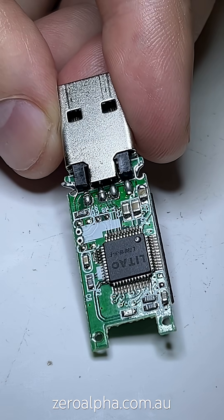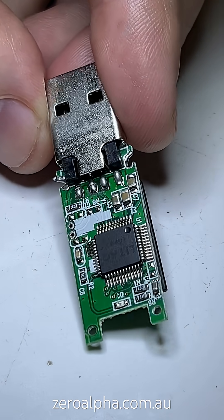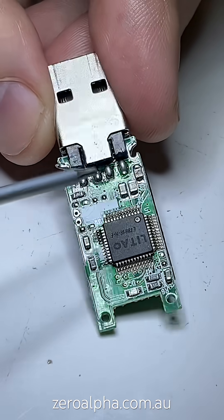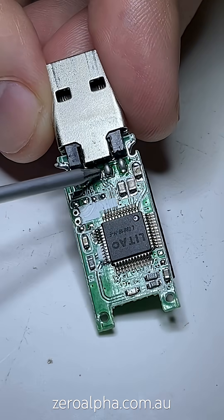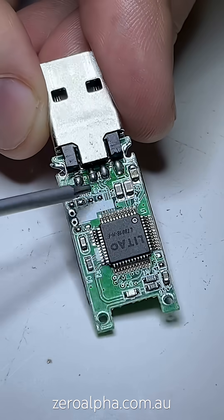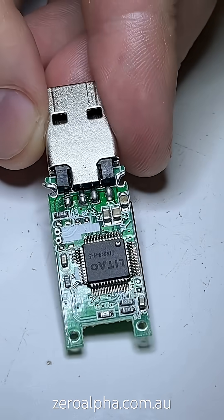There's a weird thing in consumer behavior where some people don't want to tell you the truth. I asked this guy if it's been somewhere and he says no, and he kept talking about his friend. I can tell that this has been somewhere and they've tried to re-solder this damage up here. You can see the solder's all balled up, there's wet flux around here, and solder on a capacitor — it's obviously been somewhere else.